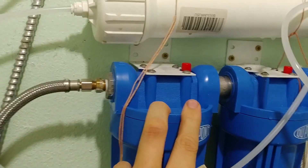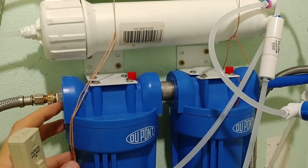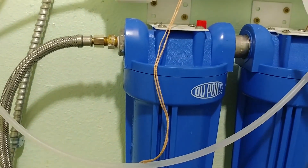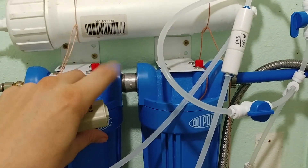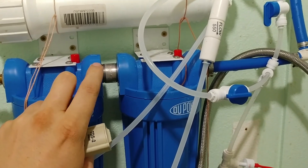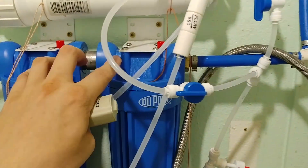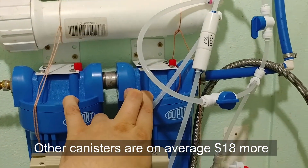These fittings have a little bit of a tendency to leak — you can see I've got a little bit of stuff coming out right here because I was messing with the tubes earlier. I'm going to take this piece off and reapply my sealant. The first time I did this I used regular Teflon tape; this time I'm going to use the heavy-duty stuff so it holds a little bit better. These are not normal threading — the threads reduce as they go in. Sometimes they work really well and sometimes they don't. I'll include these in the description. These come with the sediment filter, but the other canisters will probably be less leaky. I have to come in and reseal these about once a year.